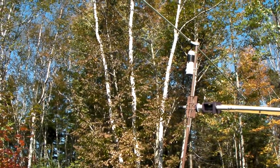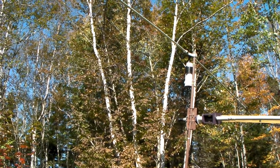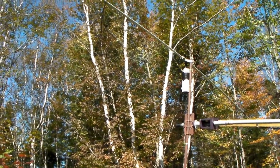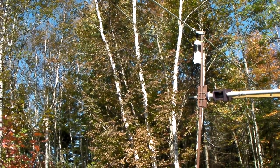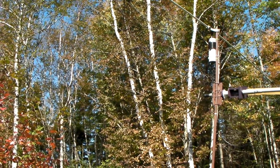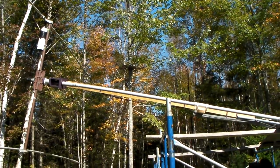Right now the resonant point has moved up a little bit, to about 14.600–14.700, beyond the assignment of the 20-meter band for amateur use. Whereas before I was getting 1.2 to 1.6 SWR with no tuner, pretty flat from 14.000 to 14.300 — I'm pretty sure it has to do with the fact that the antenna is currently aimed directly at the ground and is reacting with this steel staging, but we'll see.